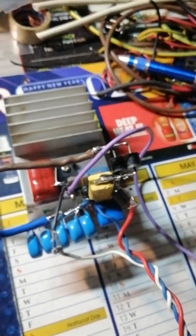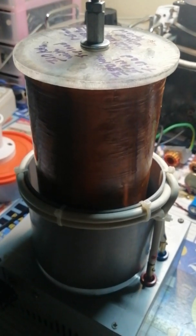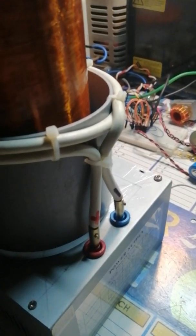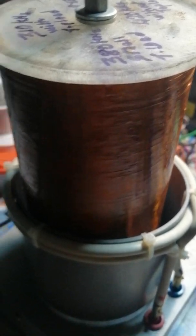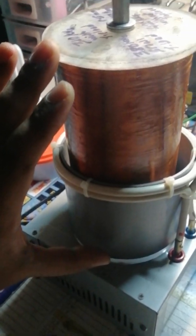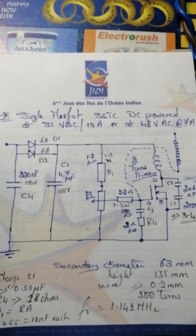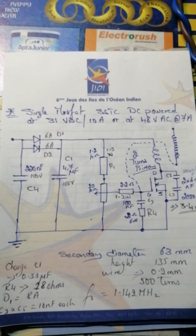It has been working very well. It was connected with this secondary, which has a resonant frequency of around 260 kilohertz. I used coaxial cable for the primary, and it has around 1000 turns. I use magnet wire, 0.15 millimeter, 90 millimeter in diameter and around 160 millimeter in height. For those who want to build the same circuit, here is a picture.